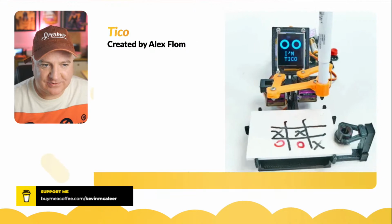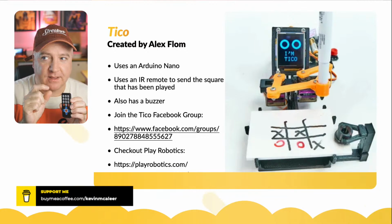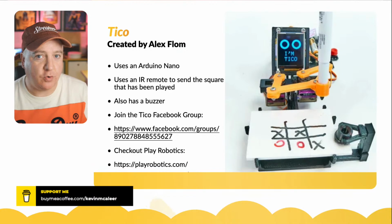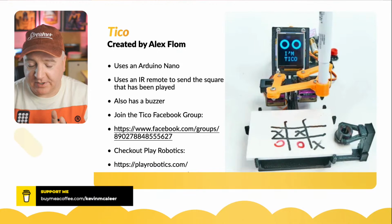I've actually got the exact same kit for this. It comes with the infrared remote and a little LED and infrared receiver. I think the LED is like the one that's in here. It can just flash out infrared, and then there's an infrared receiver that can receive that. But you have to code up all the, you know, if somebody presses a button on there, it's going to send a sequence of ons and offs, and you have to capture that and interpret that as a particular number. But it does mean you can program any remote control.